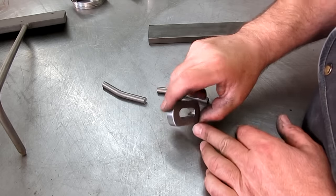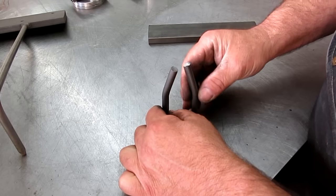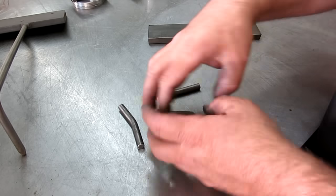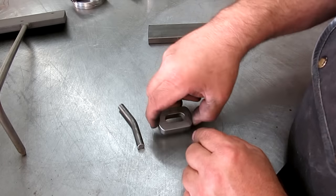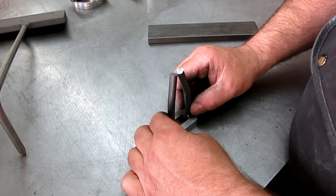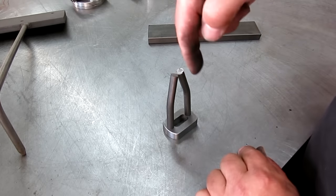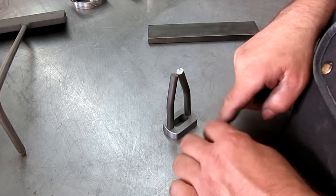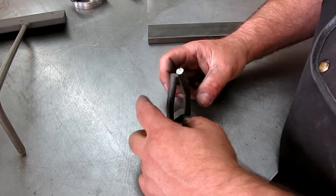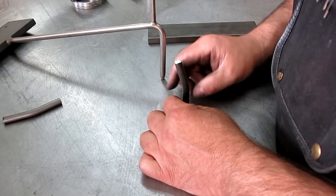Here's the little rotator after I cleaned up the ends. I'm going to add some arms on like this - what I want is for him to have a clear view as he's putting this thing down into the hole so he can see around the tool while dropping it down to rotate the valve. So I figured a fork assembly, something like that, and then I'll add the rotating rod onto this. Let me get these tacked on using my welding duck as a third hand and some eyeball-centric positioning to hold it while I get a tack on there.